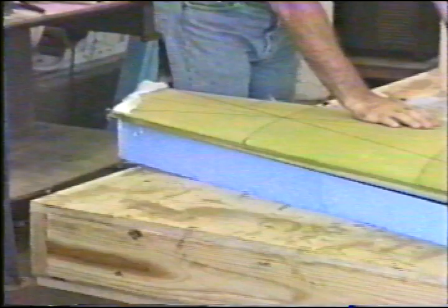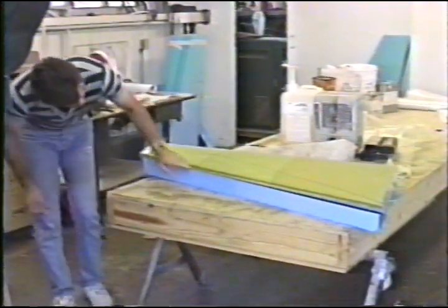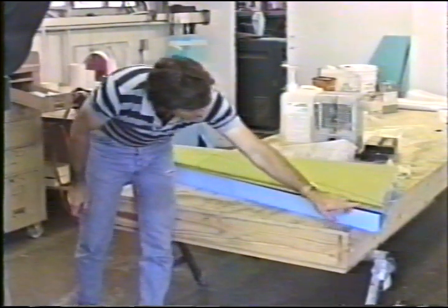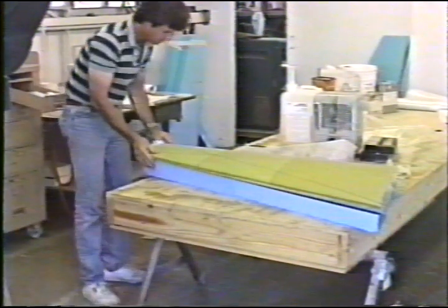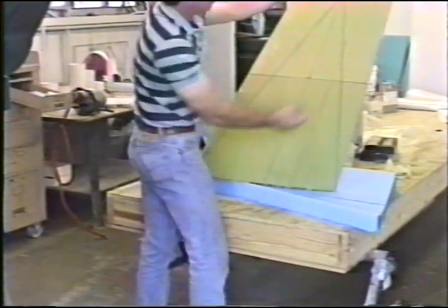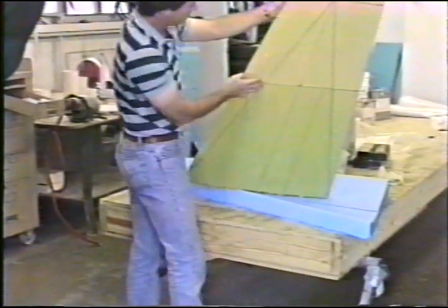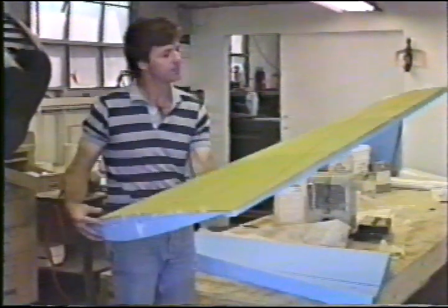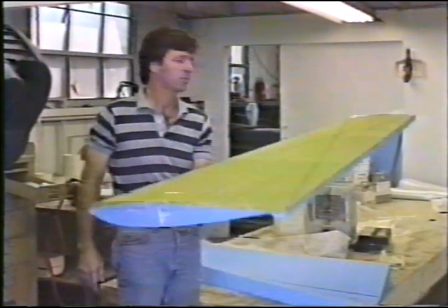We're shaping, JD. You can see the black line through the leading edge. We're going to take a small rotary saw and cut to the center and peel that off. You can clearly see through the laminate. You can see the dacron, your trim line for your rudder, the lines showing grain orientation. And it's a very, very lightweight and rigid part at this stage. We have one more laminate to do on the opposite side, another bagging operation, and your winglet will be finished.